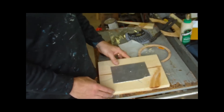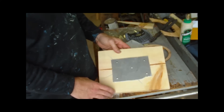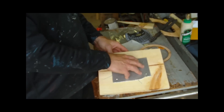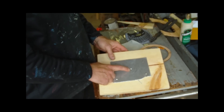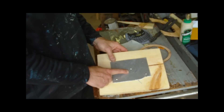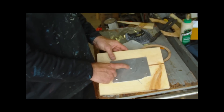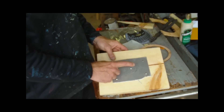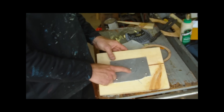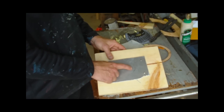On the back side, I took a piece of aluminum — I didn't want to use steel, because there's going to be a compass involved with this. I took a piece of aluminum, you can see it's just a raggedy piece, drilled four holes, and screwed it to this board. I also tapped a quarter-inch national coarse hole here and threaded it with a tap, so that I can screw this onto a regular old camera tripod. I did drill a half-inch hole behind this hole in the wood, about three-eighths of an inch deep, so that if the tripod bolt happened to be longer than the thickness of this material, it wouldn't hit the wood — there'd be an area there for it.